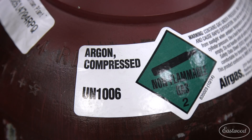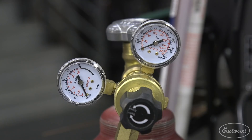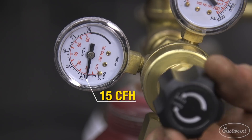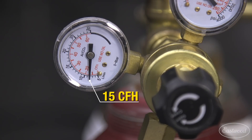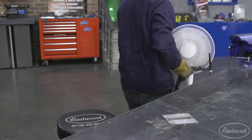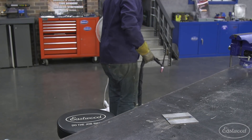As a rule of thumb, TIG welding requires 100% argon. Make sure your bottle has the correct shielding gas in it and the bottle is open and isn't empty. Many gas regulators have a separate gauge for tank pressure to help you monitor the bottle level. Also make sure your machine is flowing approximately 15 CFH when you're welding. Make sure that you are working in an area where there isn't an outside wind, fan, or breeze that could blow your shielding gas away.